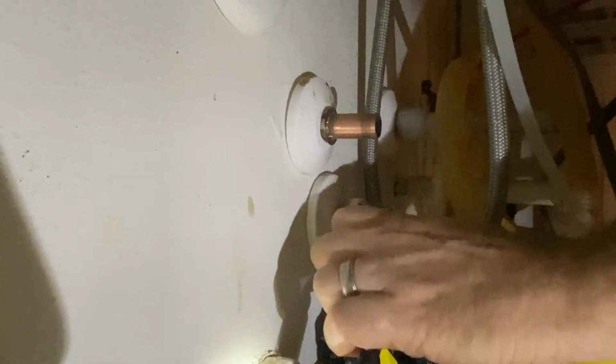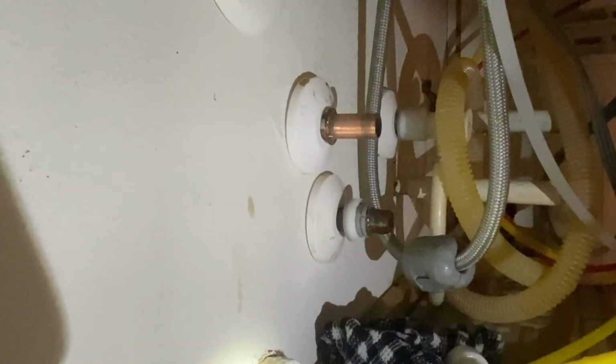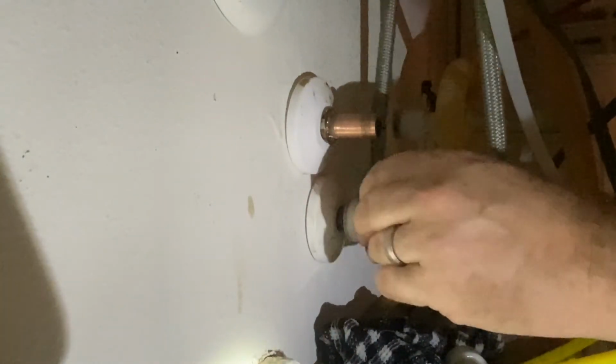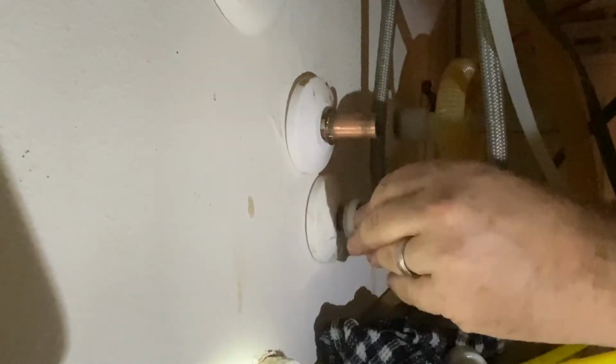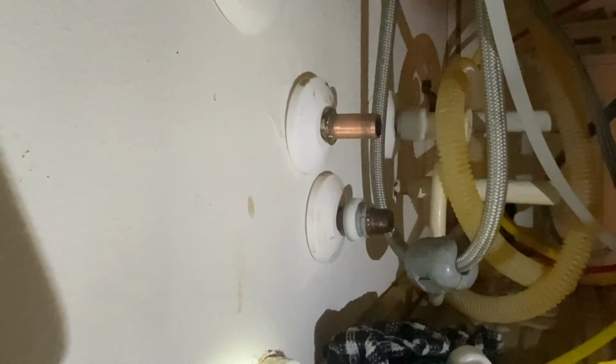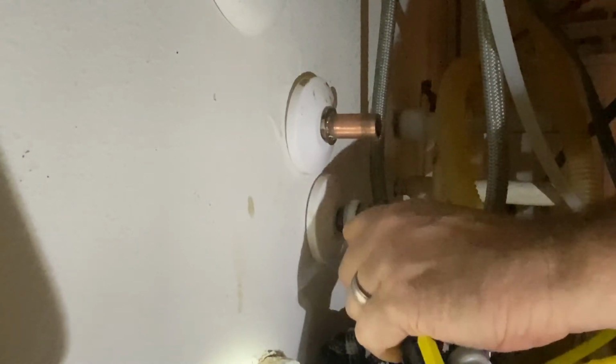And of course, no leaks is kind of the priority. So maybe I'm going to really polish these things up and make sure there are no little grooves or anything, and deburr them on the inside and the outside. And that's one thing I read too, is they talked about deburring it. I've got a little deburr tool, which I'll show in just a second, and I'll hit the sandpaper on the outside to make sure there are no exterior or interior burrs that might mess up one of those washers on that new stop valve I'm going to be installing.